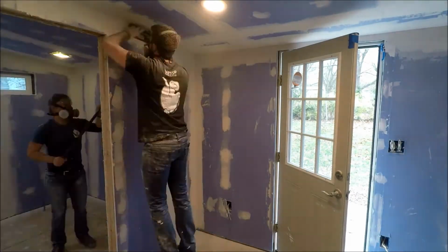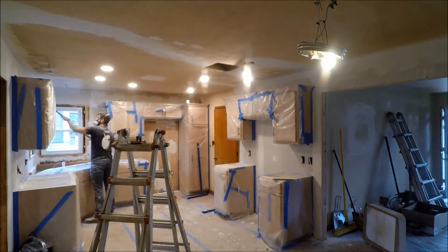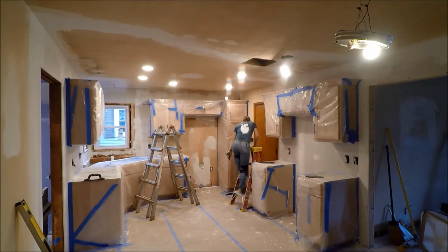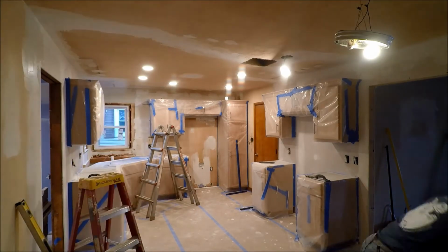Except sometimes you'll have a joint where you have two pieces of cut sheetrock, or a new piece of sheetrock edge and a cut piece butting up next to each other. That's where it gets a little more difficult, because there's no indentation for that mud or tape to go into. And that's where you have to feather it out further on the sides.